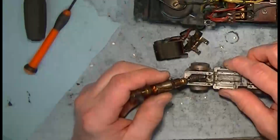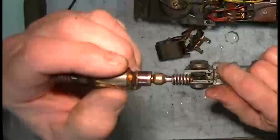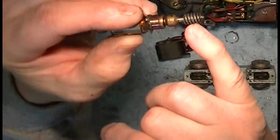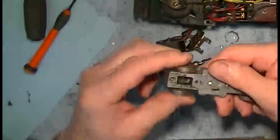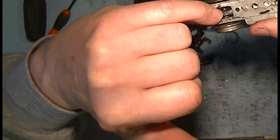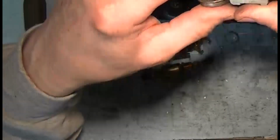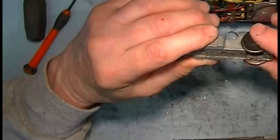So you should inspect the gears, looking for wear. On worn ones, this will start to get thin on the worm here. Instead of having that flat area, it'll almost come to a point. That means it's getting worn out. Same thing with the gear on the truck. If you look really close, you can see a little bit of taper in those. Not perfect, but not unexpected for the hours that this one has on it. Kind of goes along with the amount of play there is in the axles.